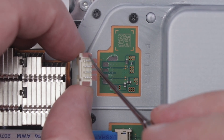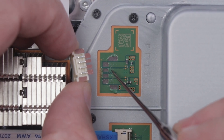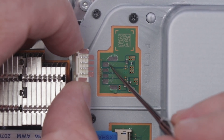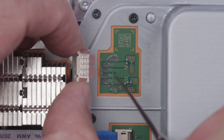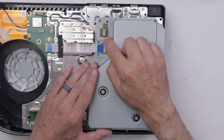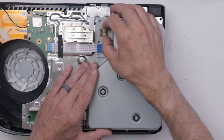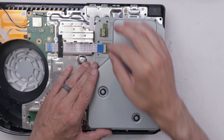In order to repair this, we need to remove these brown pads right here. Then we need to scrape off sections of the green solder mask that cover the copper traces. That will enable us to solder these little silver pins onto the parts of these traces that we scraped off. Then we'll solder it all down. We'll also need to build some mounting pins over here to mount the connector so it's not just loosely flopping around on the board. I'm actually going to remove the disk drive and disassemble it so I can get to just this board, which will enable me to access all the little places I need on the board to make sure I get this soldered on as solidly as we can.